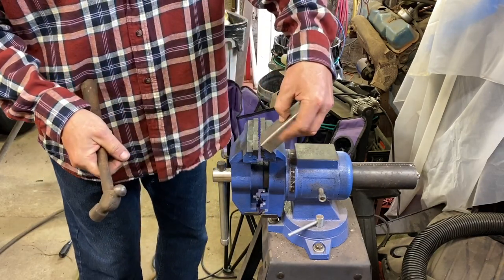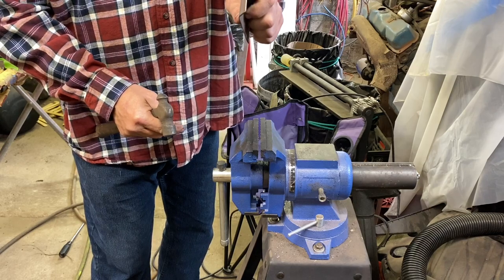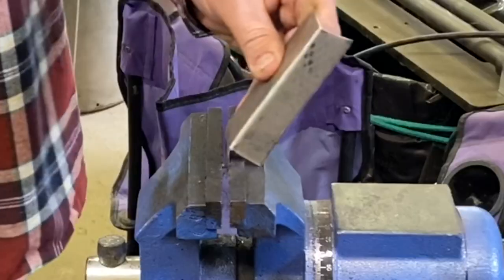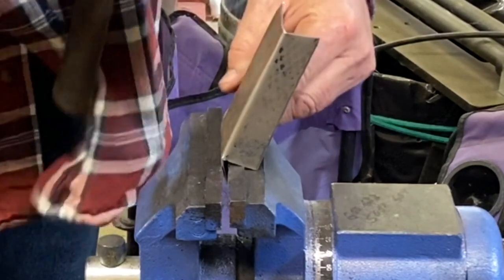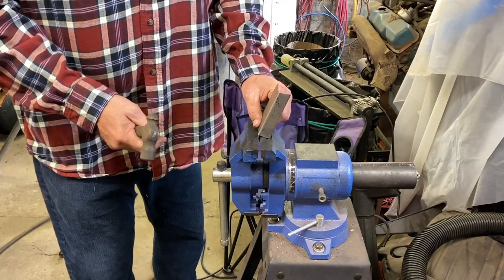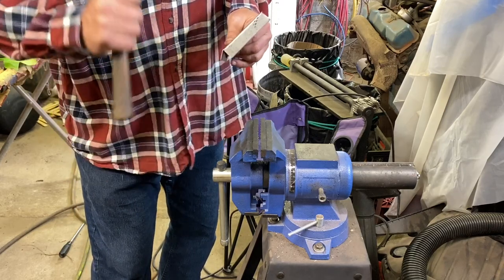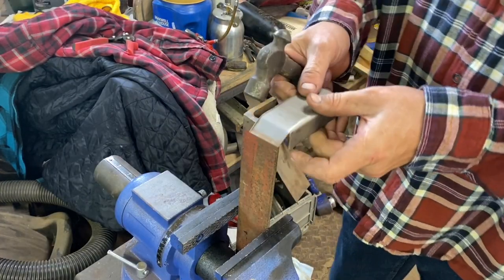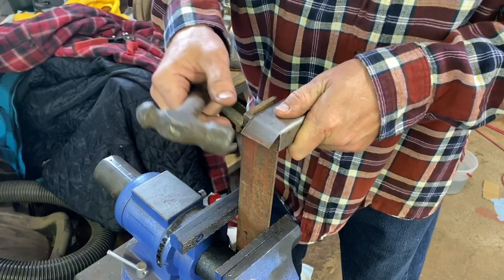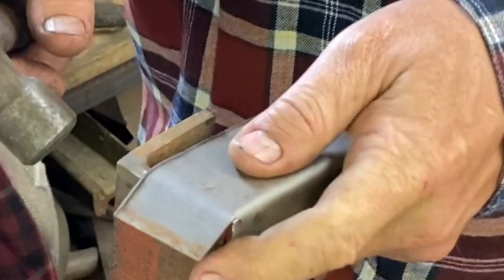Now with this piece we don't have a problem — we can just put it in the vise and bend it. But when you have a box, you're eventually going to run into a situation where the vise jaws are wider than the piece you're making. So you can no longer bend it directly. Here's how to handle that. You could take a piece of angle iron and put it on here — you kind of have to hold it and tap it down. That's one way. You can use a smaller piece of angle iron, but it needs to be at least as wide as the piece of metal you're working with.